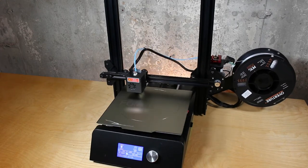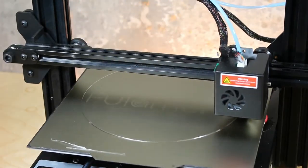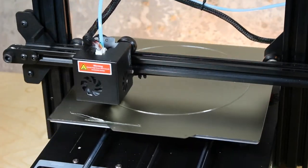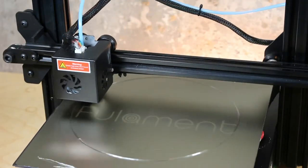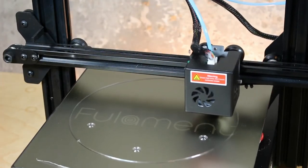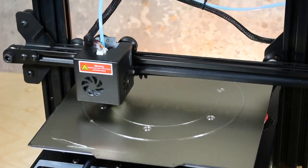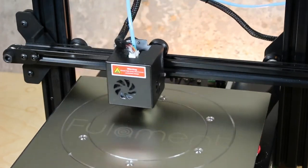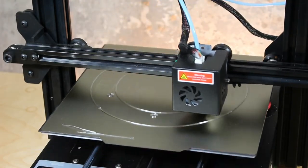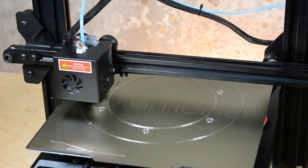This can be reproduced on any 3D printer that can support objects of 180 millimeters square or larger. You're actually going to see version 2 of this print with some minor improvements. I'm going to be using clear PETG instead of black, which is the version you've seen up until now. I've just recently switched to PETG and I feel it'll provide a good, tough structure to support the speaker. That said, you should be able to use PLA or pretty much anything else you like.